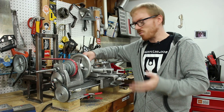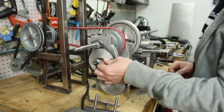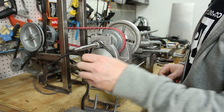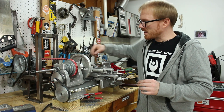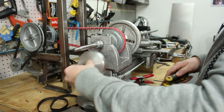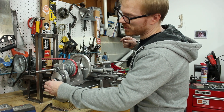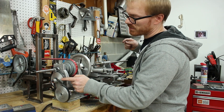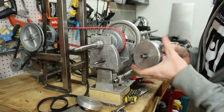I just turned down this rod to pretty much spot on 3 eighths of an inch and that will be the feed screw for the tailstock ram. The next thing I need to do is thread this rod, but first I'm going to take this 3 eighths inch arbor and use that as an opportunity to correct these pulleys — they need a crown, so I'm going to go ahead and try to take care of that now.